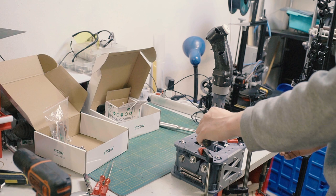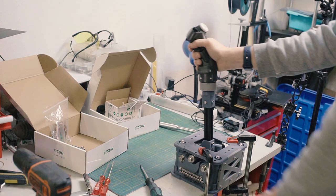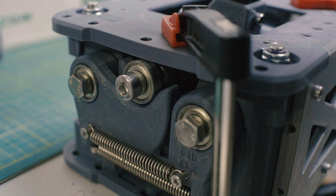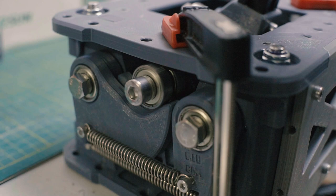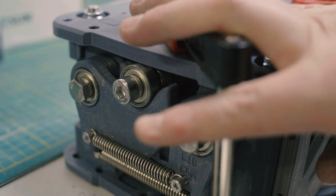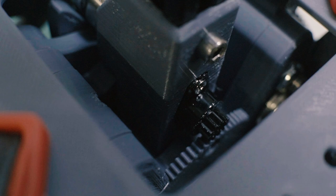There is definitely a center position, like you can feel the center, but there's no detent at all, just like you'd expect out of a cam-based design. You can feel on those medium cams, there's only a little bit of displacement in the middle, and then as it goes out, it goes to full deflection. And you can see just the amount of flex that the gimbal has on the table. That's the table flex. That's me pushing down on the table. That's the damper. You can see it reduces the... There's still, because of the strength of the spring, it still wiggles a little bit, but it definitely does a lot to help reduce the springiness of the stick.